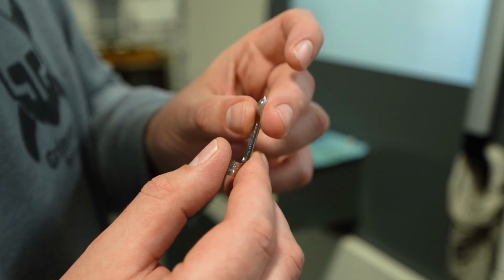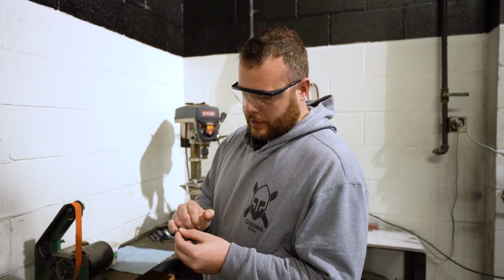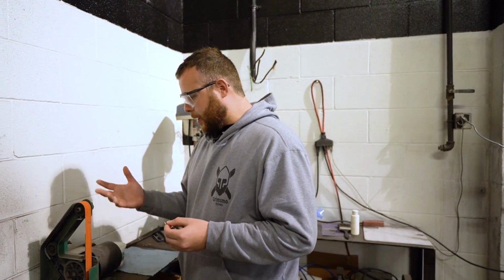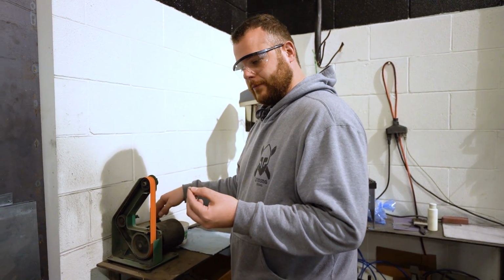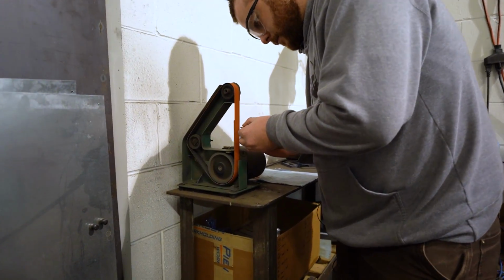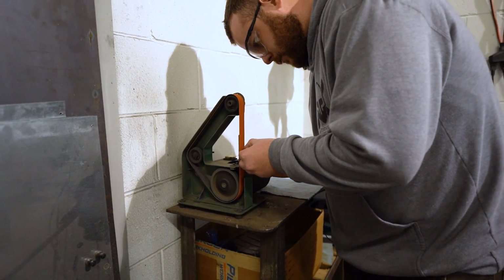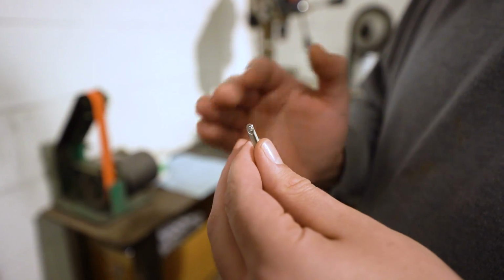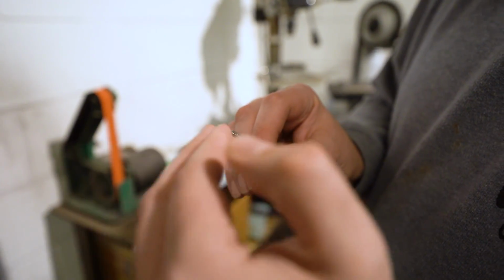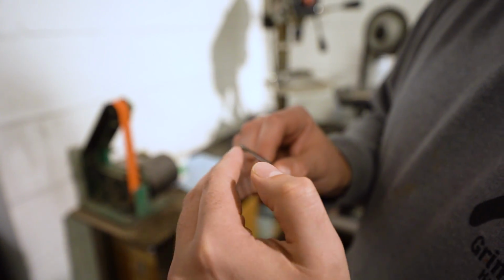All right, so this is our part. I'm going to show you guys how we're going to grind this little tab off. So follow me. All right, so now I'm just going to take off this tab. Normally you'd wear a respirator because this creates a little bit of dust, but I can't talk or show you, so I'll just do this quickly and you guys can see. So that removes the tab, leaves some material for me to buff off with the Scotch-Brite wheel. And I don't want to go too far in because there is a nice little chamfer that goes around there. And I'm stopping right before that chamfer. The rest of the action is going to come with the 3M wheel.